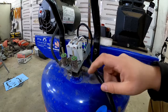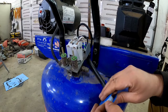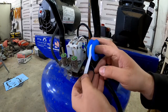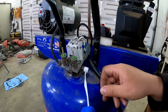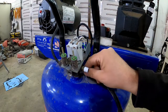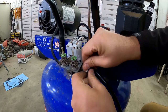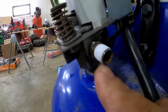Some thread seal tape sitting around. Let's wrap up this coupler. When you do this, you always want to take into account which way you're going to screw it to tighten it — you're going to go right, or clockwise. So you want to put it on so you don't undo it, but tighten it as you screw it on. Just got to get it started, and from there you'll be good. Make sure you push this outside so it's not over the opening.